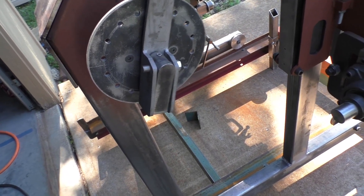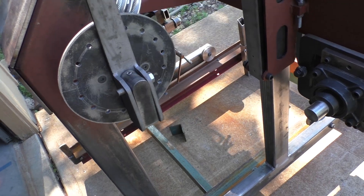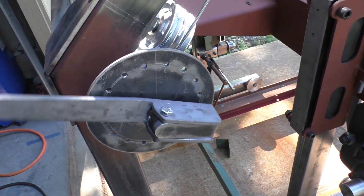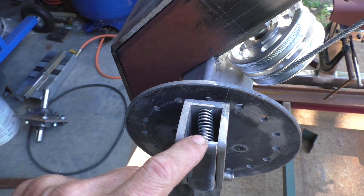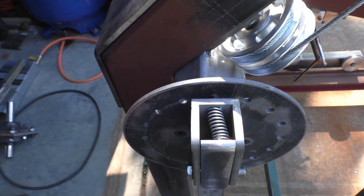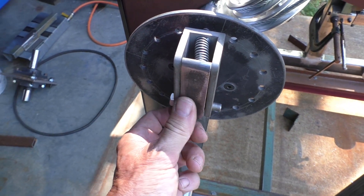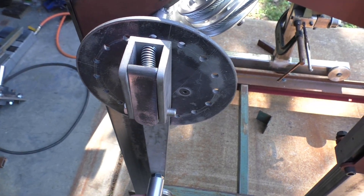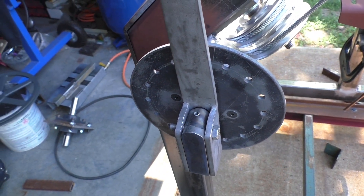Here's the rest of that handle put together. It locks — there's a pin that locks into these holes, so when you push the handle in you can turn it and this all moves real easy. Put it up against the stops, but I don't have the spring located yet. I need some kind of a pin here to hold that spring in place, but there's a set screw right here that can be locked. That's what goes into the hole to lock things. You can see there's a collar right here that this flat bar is welded onto, with a hole through it to pivot on — that's what allows the mechanism to work — and then it's held onto the jack shaft with a roll pin.